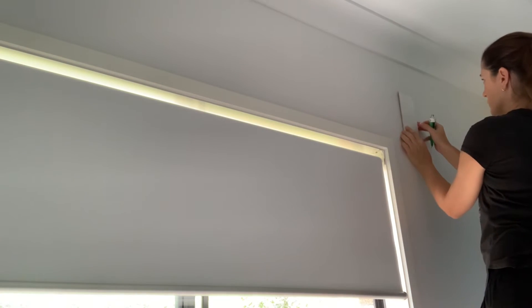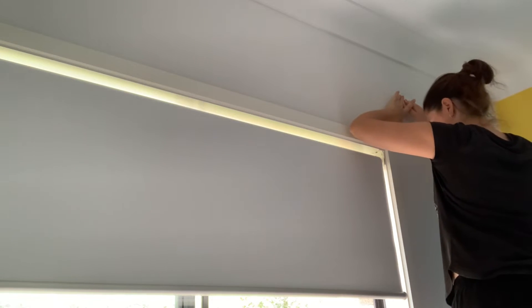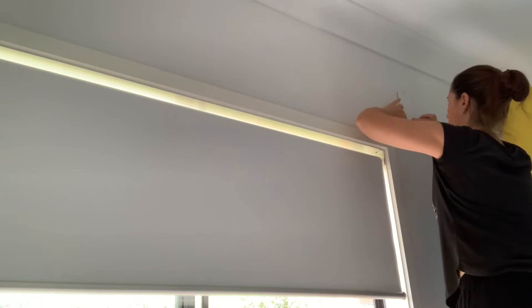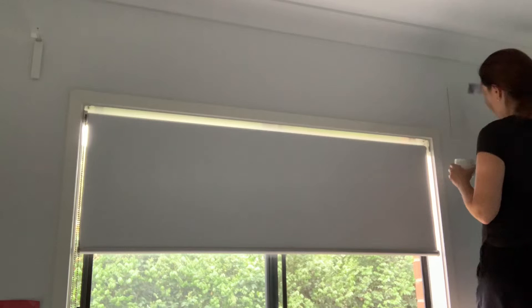This piece is going to be crucial in anchoring the curtain rod back up to the wall. I'll be able to screw through this timber into the wall and it adds an extra layer of support for the screws, so they're unlikely to get ripped out of the wall like they did last time when they were drilled straight into the plasterboard.